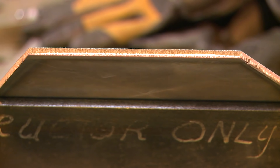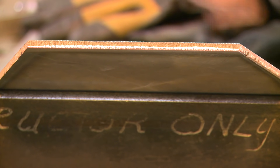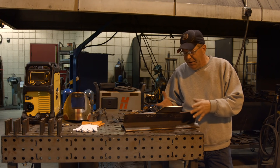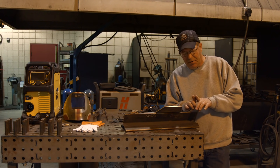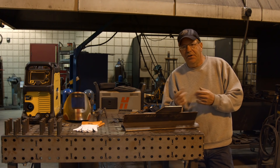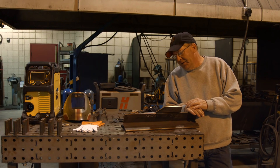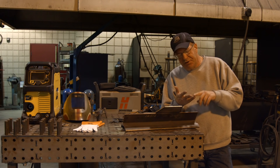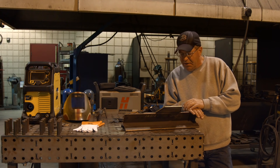We're not getting super critical on this particular part. This would be used for the base of the pentagon — the very bottom plate. We'd go ahead and knock some holes in so it would breathe, then fit these up and wire feed them. Three sixteenths welds real good with a corner to corner fit. You can gap them open a little bit, get a hundred percent penetration — real super easy to work with. So a quick torch demonstration: pressures, clean tip, your layout — things come together nicely. Don't have to spend a whole lot of time grinding.